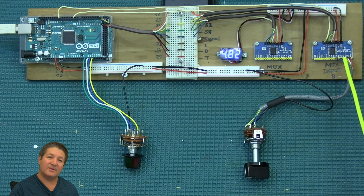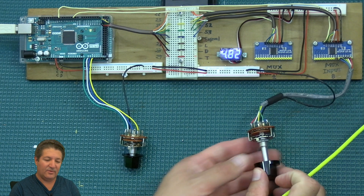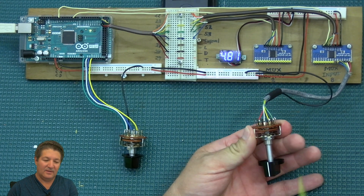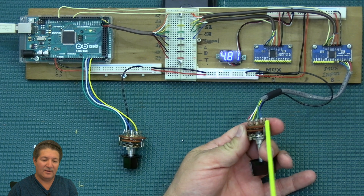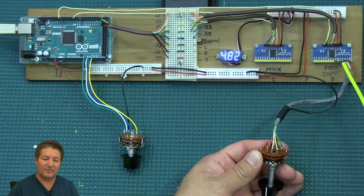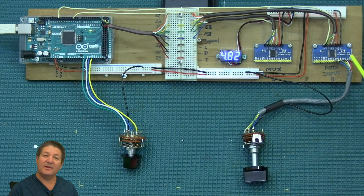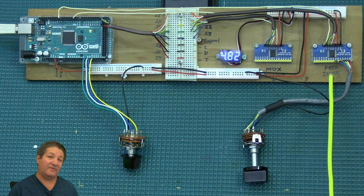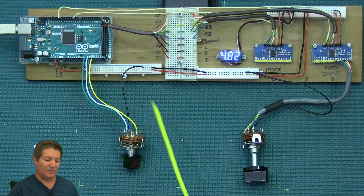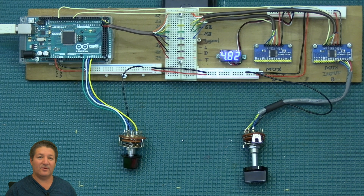For this one, I've connected it to a multiplexer. You can see the switch order starting from this side is red, white, yellow, green, and blue — so over on the multiplexer it needs to match that same order, which it does. It goes in ascending order. When we assign functions to rotary switches, they start at the lower number — on the multiplexer it'll be pin 0 through pin 4 for a five-position switch, or A8 through A11 directly on the Arduino for the four-position one. It always goes in ascending order and must be in the correct order.